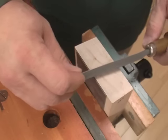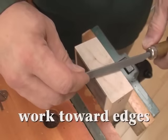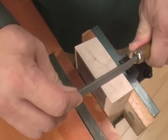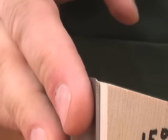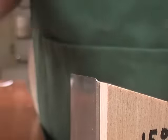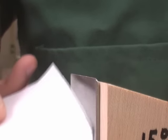To do that, we're going to use a diagonal stroke starting from the center and moving toward the edges. You don't need to press extremely hard to get the job done — this is a very fine edge on this plane blade. After a few passes, check the condition of the burr by running your fingertip right along the edge very gently. You should be able to feel the burr start to develop from one end to the other. Another way to tell is by running a piece of paper along the blade and seeing if it catches against the burr as it travels along.